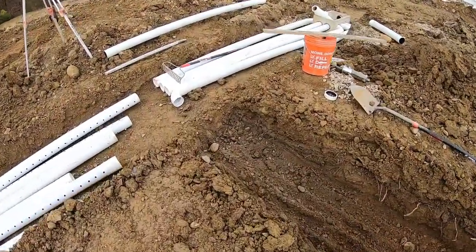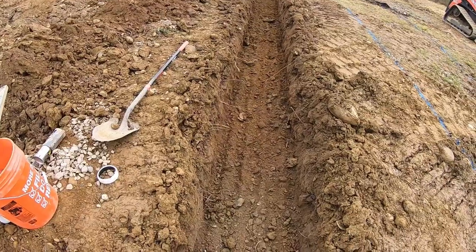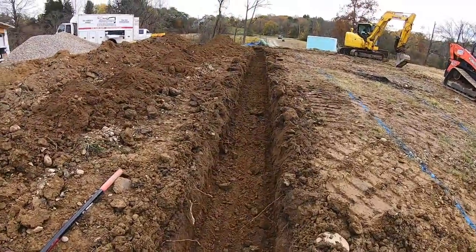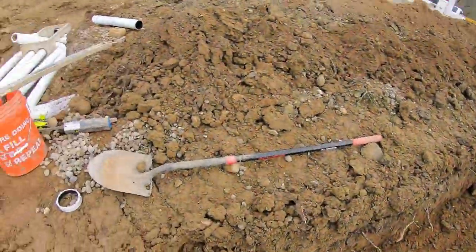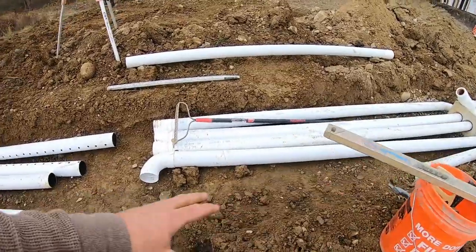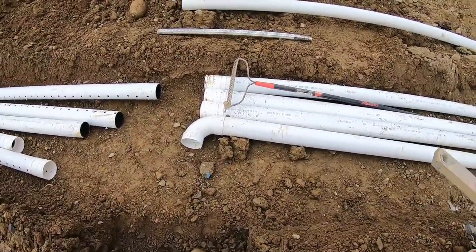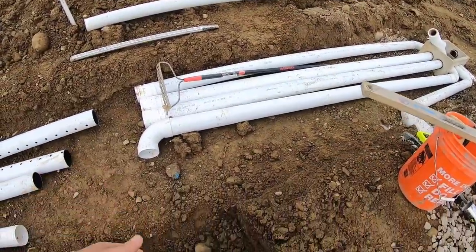Back on site. So on a third trench here, just got done doing that. Now I go through with a rake and just rake it out, even though it's pretty good. I mean, you could just put the stone in there. It's shot with a laser around the boom. But once you get your trunk, you know, you always gotta have your measurements. So once your trunk is, you do your trunk at the bottom of the pipe. Then you gotta do another six for stone.